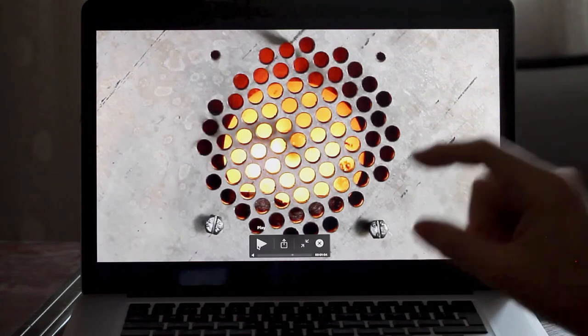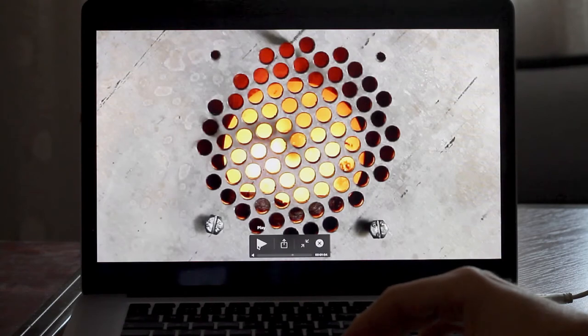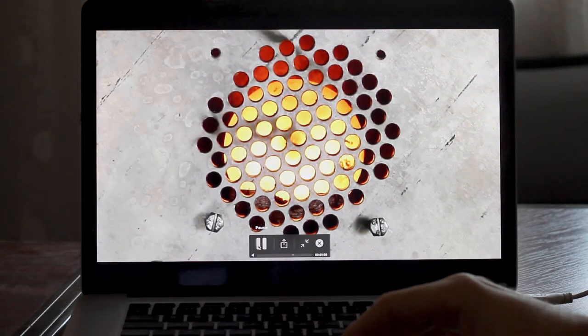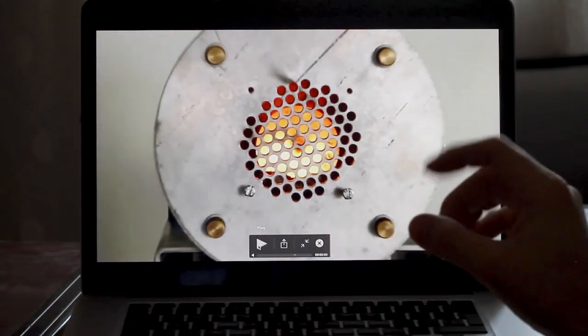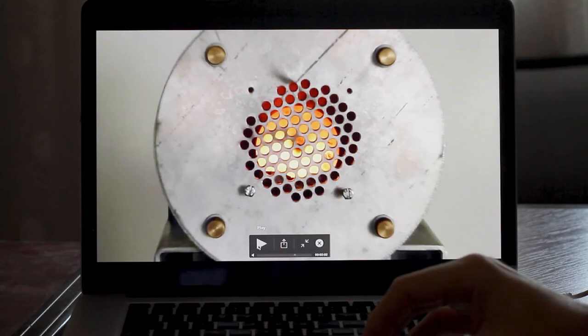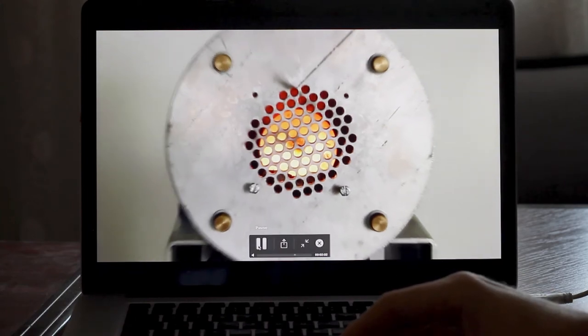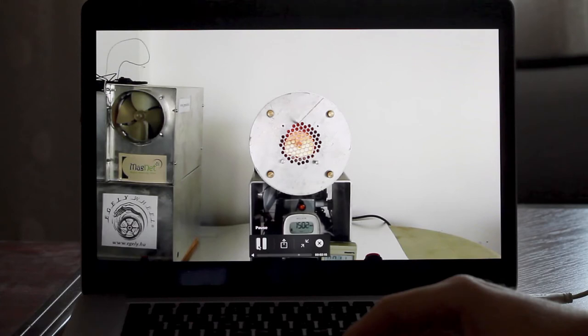So that hump that is 100 hertz. 100 hertz, but of course there are higher and lower frequencies, but the 100 hertz component is the loudest. And of course, there was a slight tonal shift there, and that's because of the temperature and the environment. It's changing. No, I mean, the system is gradually being heated. Therefore, the fundamental frequency, though, is 100 hertz, but the other tones, the higher frequencies, are changing.